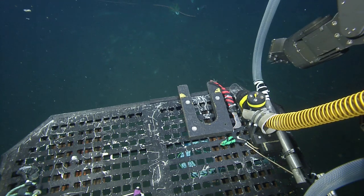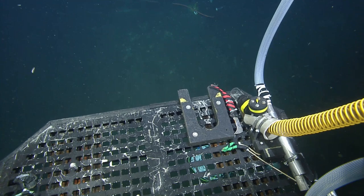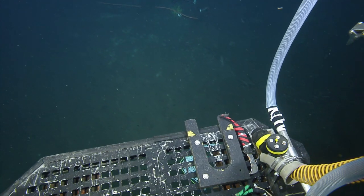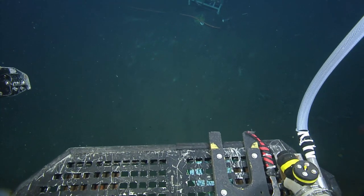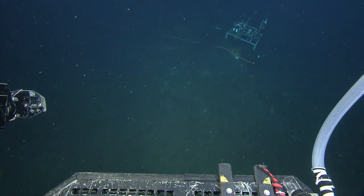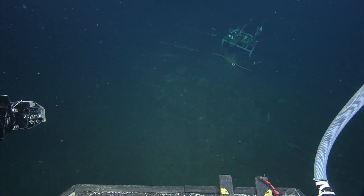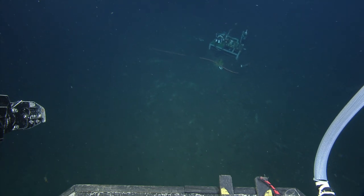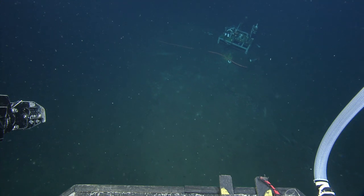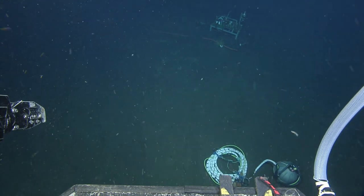So we might have to first fly the package closer to the caisson, otherwise the cable is potentially going to coil up on itself. Right. Because it feeds from the top, and it'll be hard to pull the instrument all the way back from the bottom of the coil, so we might have to start further.